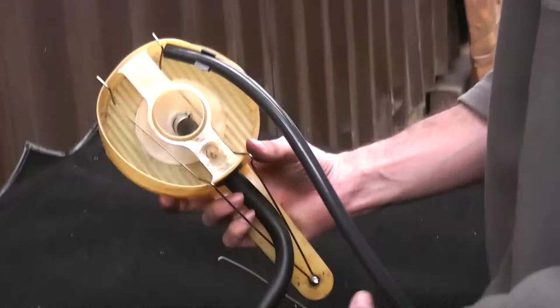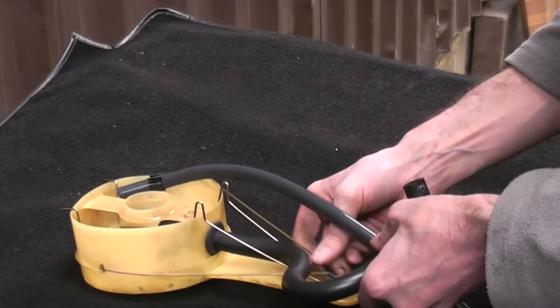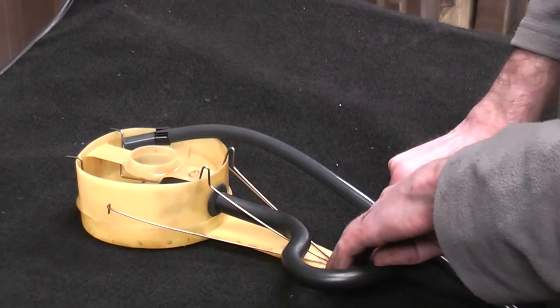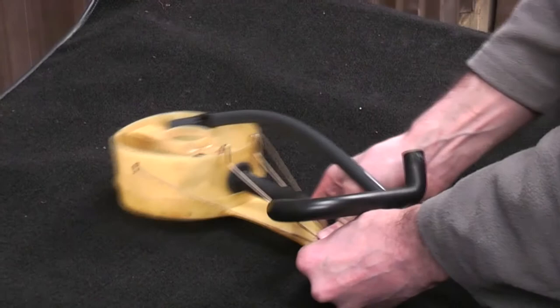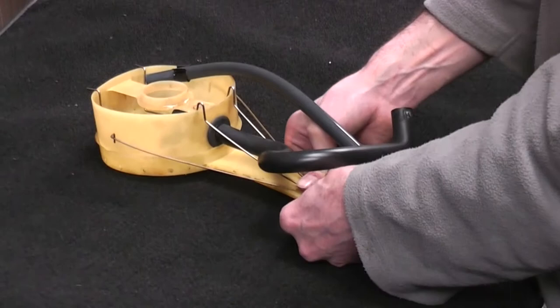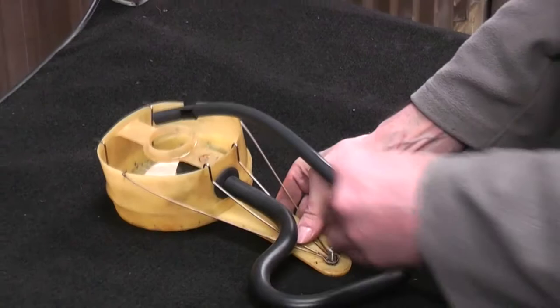This is the second clip. Make sure you put it in the right way up — the little prongs have to point down. This is much easier to install because you simply put it over the stud. You can then get your big washer and nut and do up the baffle. If you move the baffle from side to side inside the tank, you'll feel there are two nobbles in the tank, and you'll feel the point at which the baffle wants to stop and rest in the centre of the tank. Then do the nut up, not too tight so you don't snap the stud off. Then simply reach in, lift up the two hooks and just hook them over the side.